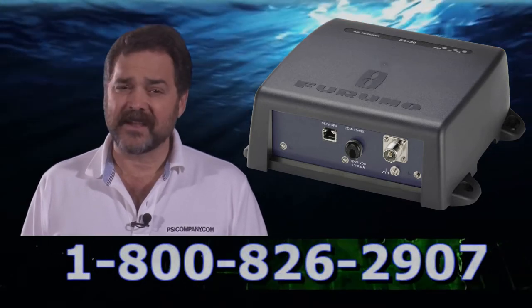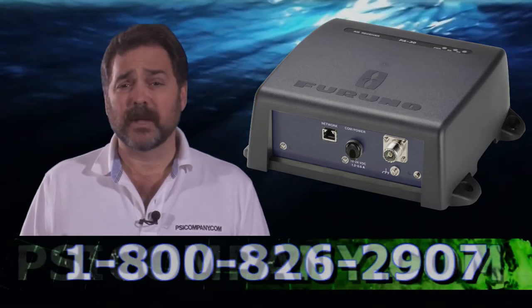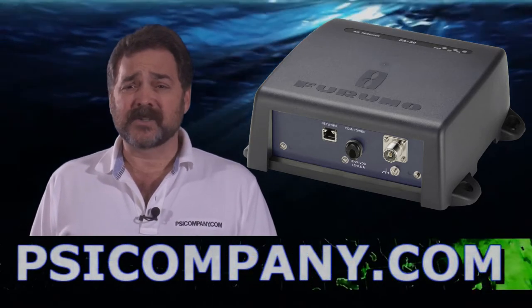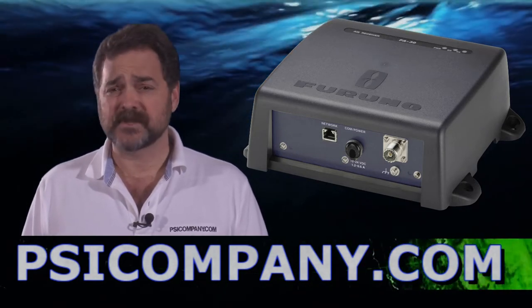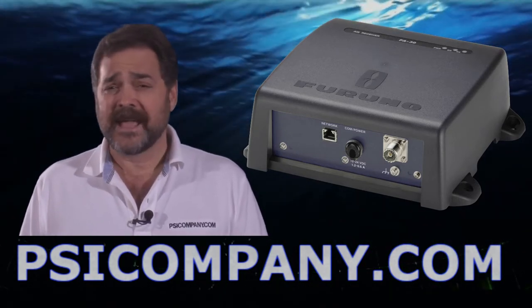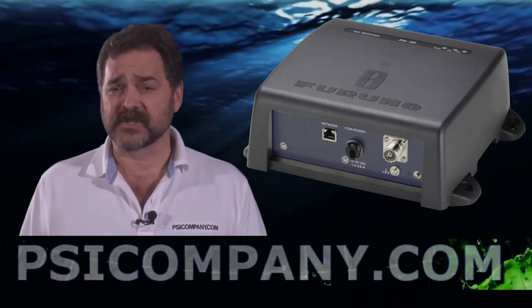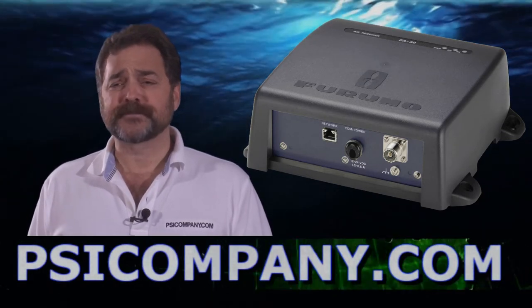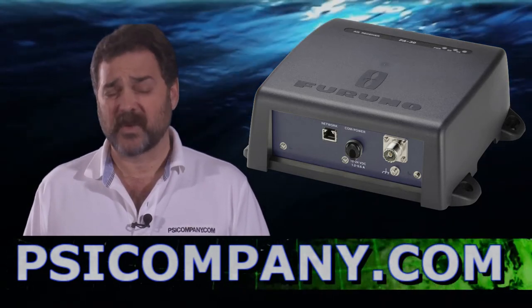It's very handy to have AIS information on a vessel — you can see around you. The AIS network helps display MMSI, that's the maritime mobile service identity, the ship's call signs, the types of ships that are around you, the location of ships and their heading, the course over the ground, speed over the ground, and heading of the vessels around you.